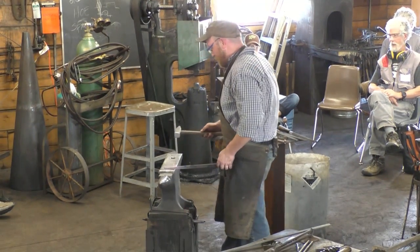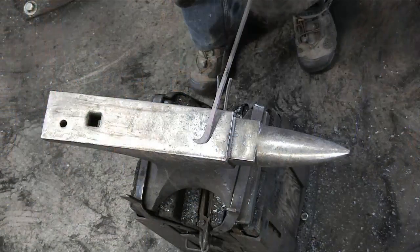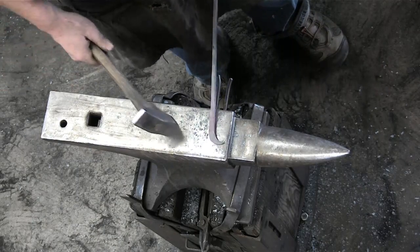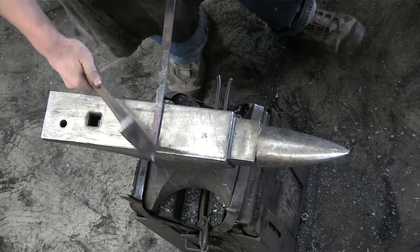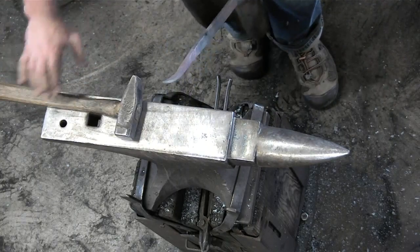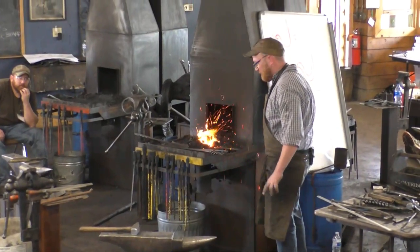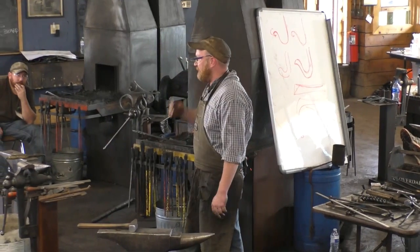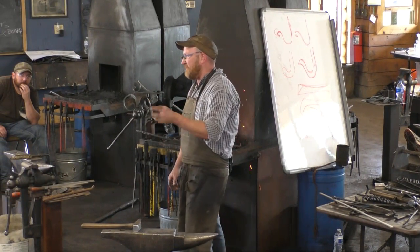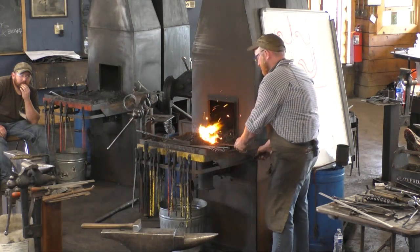It's just kind of a plain Jane, run-of-the-mill hammer. We bought some new ones for $30, so they can't be that expensive. But about a kilogram is a nice weight. It's just a nice weight. You can swing it fast, and for most small shop scale work, it works pretty well. If I'm stepping up to something like tongs or something out of 3/4 square and bigger, then I'll switch to 1500, which is a little over 3 pounds.